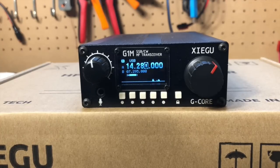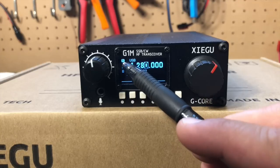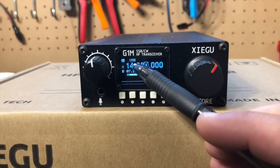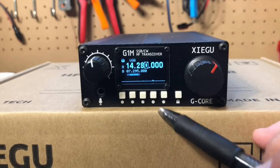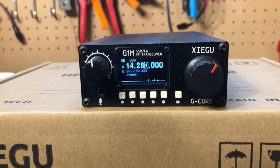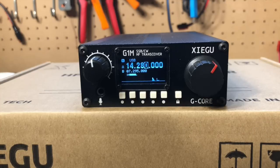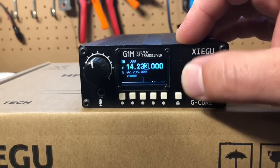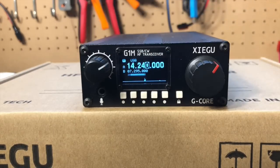So right away we can see not a lot on the screen, but it's got everything we need. This little R here just tells you if you receive or transmit. You can see we're in USB. Got a nice easy-to-read display on the A band. We've got our B band, an S meter here. And then down in this very bottom line, this is our real-time spectrum scope. This is adjustable — we can go into the menu and configure how high or low we are receiving that signal. So we can tune around and find some signals here. Guy's coming in S7, S8 — pretty sweet. And that's 9 plus 10 now!